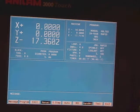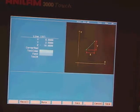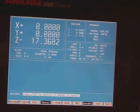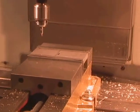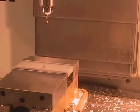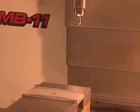I'm now going to enter a line move in three directions at the same time. You push the line button and up comes the line menu. I'm going to enter X equals 6, Y equals 2.5, Z equals negative 10 with a feed rate of 20. Z negative 10 will bring the Z-axis up because it's currently around negative 16. When executed — you push the execute button — the tip of this drill will sweep out a space diagonal. It is complex three-dimensional movement like this which makes milling 3D complex geometries possible.